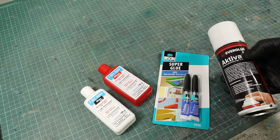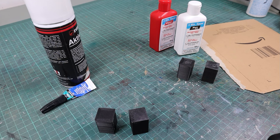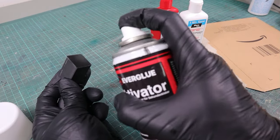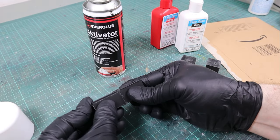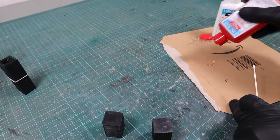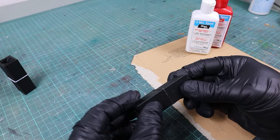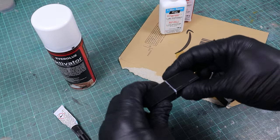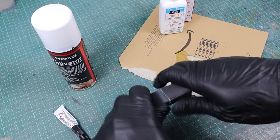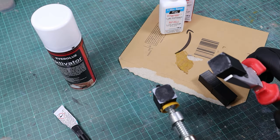I made a quick test with these pillars to compare the force needed to rip them apart after the glue dried for a day — two with superglue and accelerator spray, two with epoxy. The accelerator spray is a game changer because it literally cures in 10 seconds, and you can actually see the curing process in that white residue. My non-scientific test revealed it was more or less the same force for both, but I still trust 5-minute epoxy more in the long run because superglue can become brittle over time.